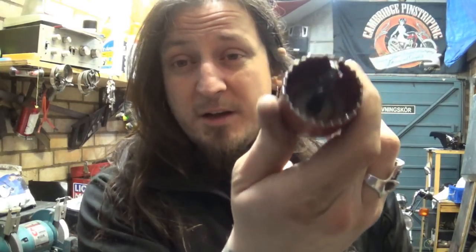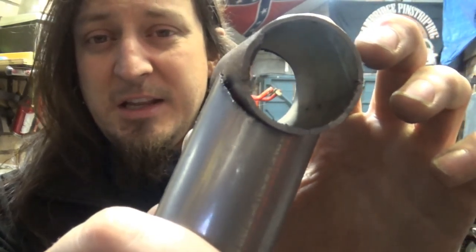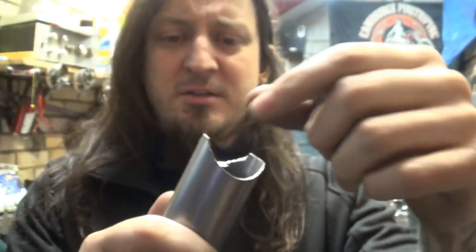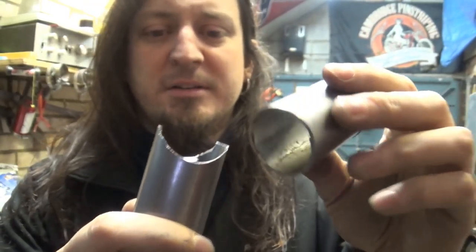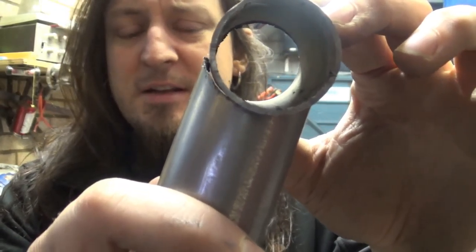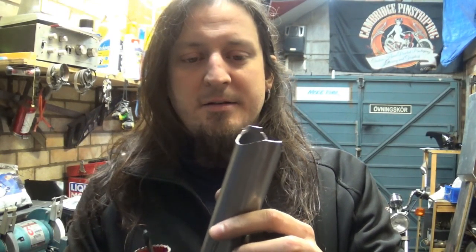But then I've done the same thing with a hole saw. I built a little jig. I used my press drill for that, and the result I think is way better for the same piece. You can see, even without touching it with any angle grinder, finessing it, it's already a way better fit. Obviously I need to get rid of all the rough bits from around it, but it fits the pipe near enough perfect without doing anything else. So I think I'm gonna go ahead with a hole saw, the right diameter, same as this. I think I'm gonna perfect my jig slightly and finesse it and see what happens. Catch me in a minute, guys.